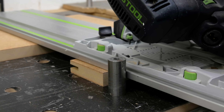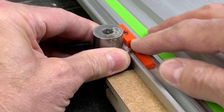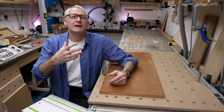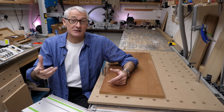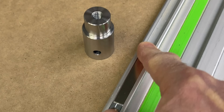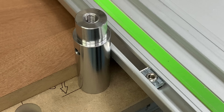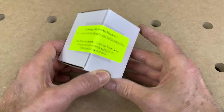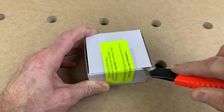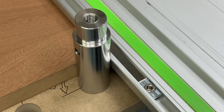I mentioned in the rail square versus MFT video that sometimes when using a rail against taller dogs or hooks like these, the rail can get away from you and move slightly. One common solution is using little spring clips on the rails that attach to the dogs. The Vario Bench solves this in a unique way: the bench hooks are made from a particular type of stainless steel that's magnetic, and you can get a pair of magnetic rail clips as an accessory. These slide into the rail slot and keep the rail butted up against the hooks, yet are still easily removed when you need to get to the workpiece underneath. These magnetic clips are very strong and come with all kinds of warnings on the package — but they are absolutely unique. I haven't seen this anywhere else, and it's such a clever, obvious, and simple idea.